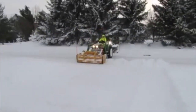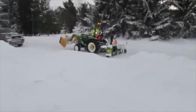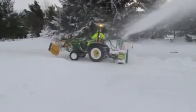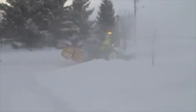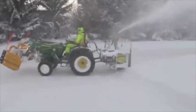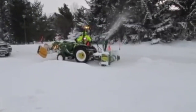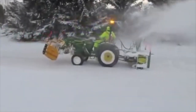As you can see here, the setup that we made was this little John Deere 3032E with a Kotec box blade on the loader — we welded up some John Deere loader mounts on that box blade, put the blade on the loader itself, and then ran a Frontier regular rear blower on the three-point with some extensions on the blower just to get it a little bit wider. The idea behind that was we wanted to be able to back drag away from the garage doors without leaving a pile, but also have the capability to use just the regular blower in a super heavy storm.